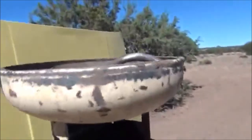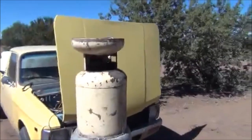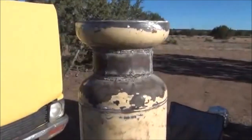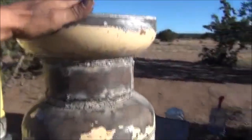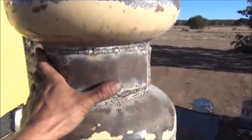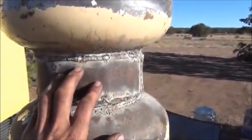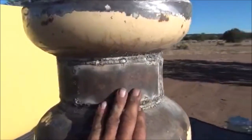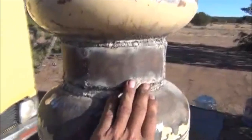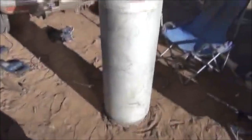Here's a quick update. We've finally sealed up and welded on our reverse bowl here, which will become the ash reduction bowl setup. We've put an extra piece of quarter-inch steel all the way around our reactor zone — our reduction zone — and that's going to allow for the fact that this gets so hot right here that there was a possibility that the steel could have melted down if there was ever an issue. This will give us a little more reinforcement for this zone. I can increase the temperature slightly in there and get a better reaction taking place. You can see now that this is all ready to go.